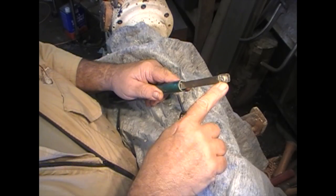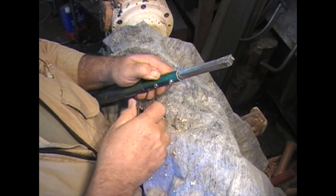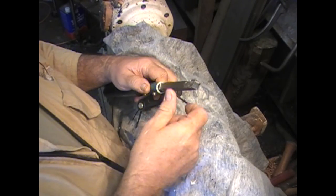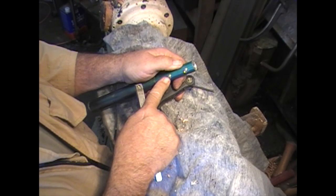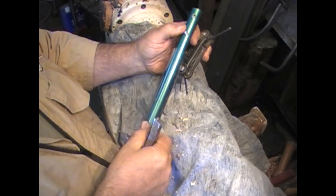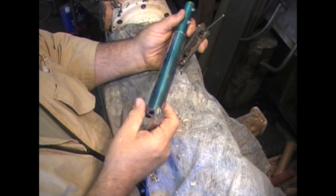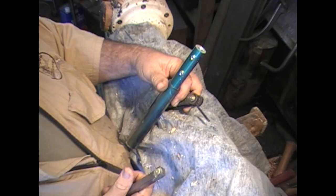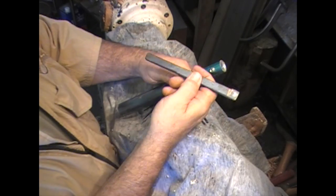This is one of my R2 cutters on my half-inch bar. This guy took a piece of half-inch aluminum conduit from the electrical supply company and drilled and tapped it for two quarter-inch Allen screws. This handle is only about 10 inches long, and for a sleeve on it he's got a piece of one-inch plastic water pipe from the hardware store slid right on there. I've got a whole bunch of this plastic pipe and I just didn't figure out how to make these connectors better — still in the R&D phase. Then he took the cutter bar and shortened it to about eight inches.